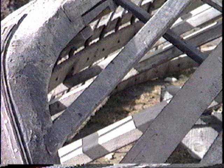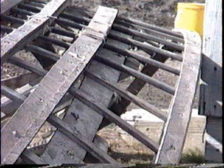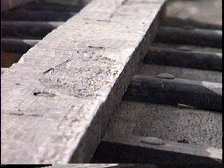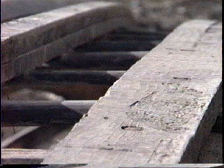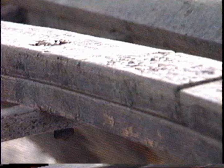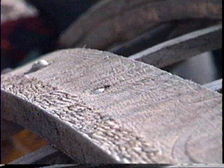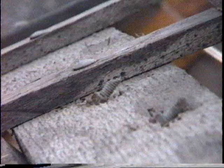This inner stringer is very important. It runs beneath the seats, and the skin is run over the gunnels and attached with line laced along this inner stringer. What is very important about the structure of this umiak — so that it can change its shape in the ice — is that the stringers are all attached to the ribs with only single point attachments, simply bolted through at one point each.